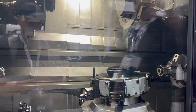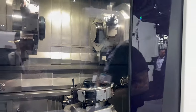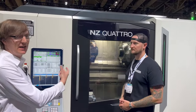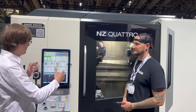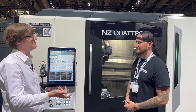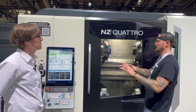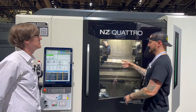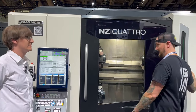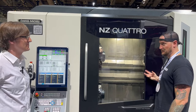Now what size of workpiece can I fit in here? I think most customers will use a bar feeder with a turn-and-unload situation. So around a bar diameter of 45 or 65 millimeters. So you hook a bar feeder into it, it pulls into this side, does the whole first side of the part, and then it gets fed automatically over to the second spindle to repeat that process.